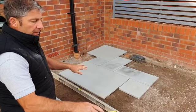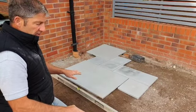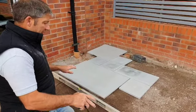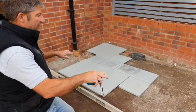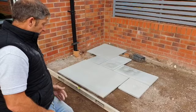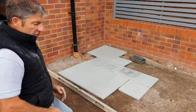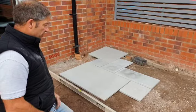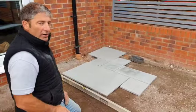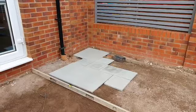Like I said, each level, when you're putting sub base in, and we put a dry lean on here, we put an MOT type one, then we've got the lean mix, and the level is reflecting the finished laying course. That's what you've got to look at. So we've got 30 mil there over nearly 2 metres, so that's more than sufficient. And if you look at that, it's not looking as if it's just running away, and it's on a big slope, so that'll work out perfect.